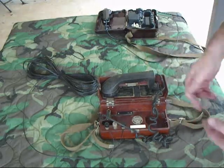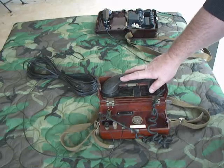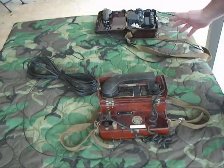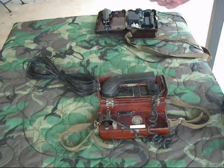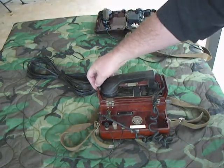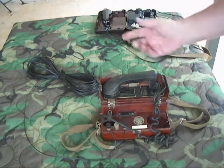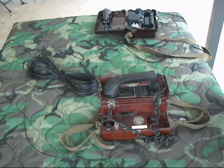And that's one of the reasons you have to have all the batteries — 9 volts. It's got, I think, three transistors — I don't want to be quoted on that. A lot of the Soviet phones that came out around that time have transistors and they use 9 to 10-volt battery packs. So that's basically how this one works. It's got this rubber piece right there where you could actually run the field wire through and the handset through, close the lid, and operate it closed.